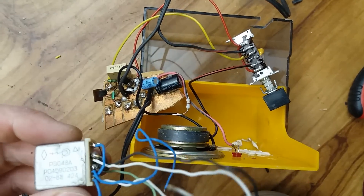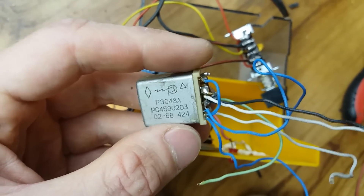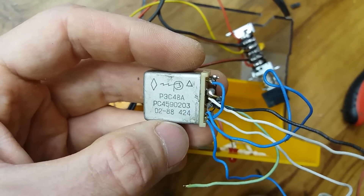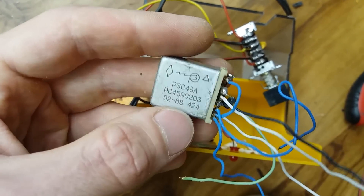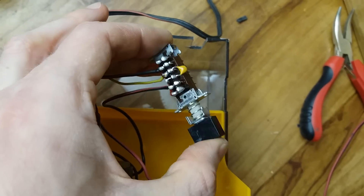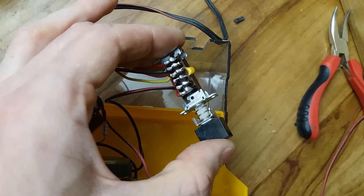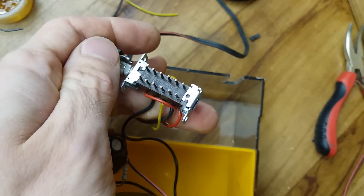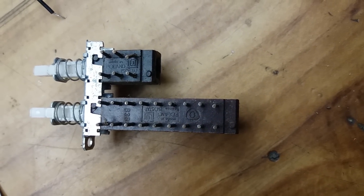But let's go back to this thing. I decided to delete the relay. It's some sort of Soviet relay and the coil actually clicks on at about 10 volts, which is not very convenient for a 9 volt battery — I was running it originally on a 12 volt supply. This is a Soviet relay from 1988. I am replacing it with a switch like this: double pole, double throw — actually four poles and double throw — but I am doubling up all the contacts for more reliability. This is an old switch made in Poland from my box of old switches.